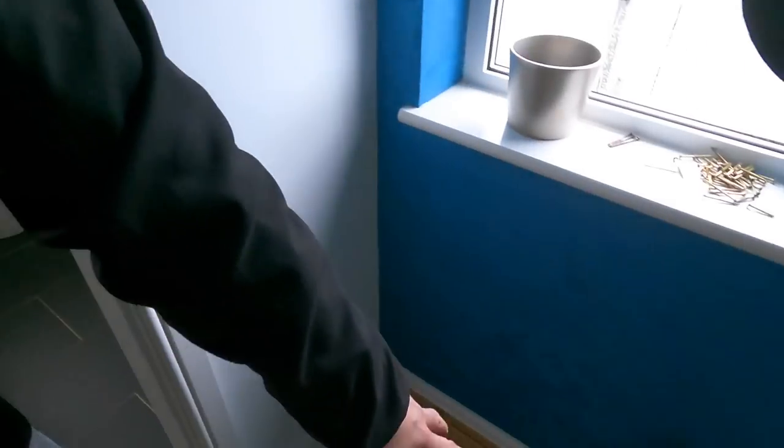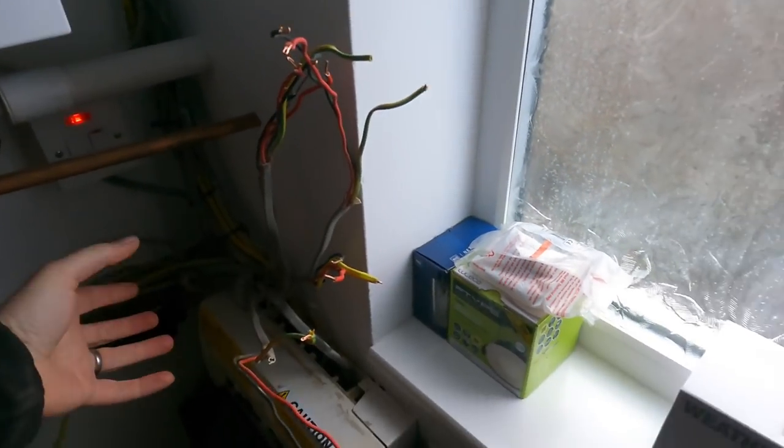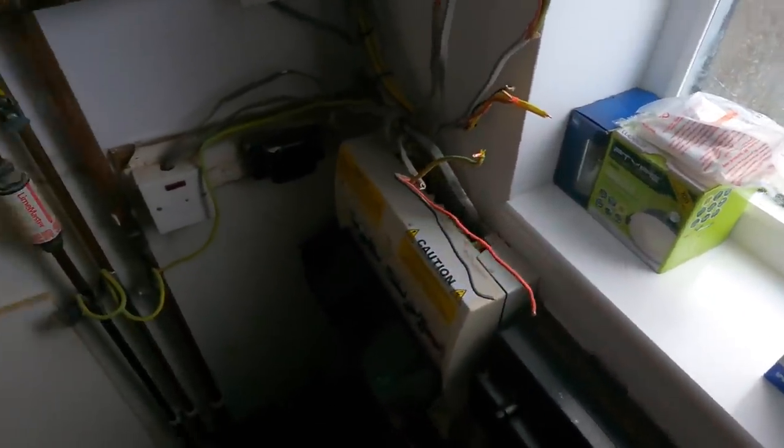So my plan for cable runs is, we're going to come down from this board, which is directly underneath us here. I'm going to try and get some 4x2 trunking right into that corner, and then lead that across, which Jack's just got ready on the old drum runner. And then, so we've got really limited space. So you see all that little mess that's going up there. We're going to try and tuck that in that corner down there, and then I've got a plan. I think what I'm going to do is run some 4x2 across here, and then mount the new board in a similar location. Obviously that's going to come off, so whether I can try and drag it on a little bit further. But obviously I'm limited with all this down here. So that is the plan.